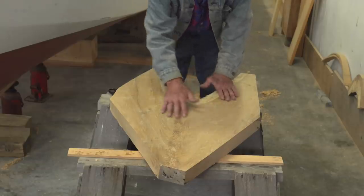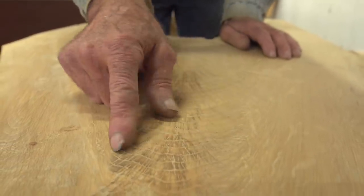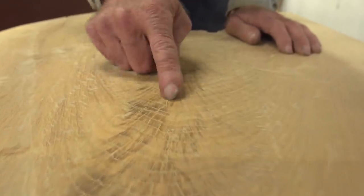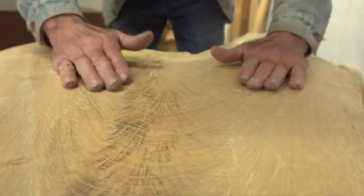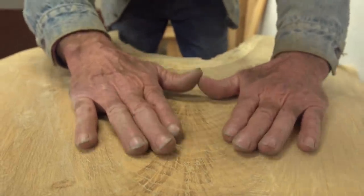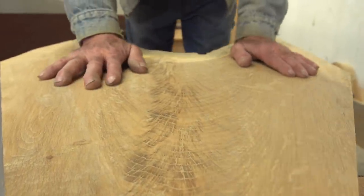Look at the figuring in this thing — it really looks nice. You can see the annual rings in here. They're kind of round up here, but then look in here — they're nice and pointed. All of them are pointed and they line right up with each other. So we're going to try to keep that right down the middle of the breast hook so it looks even on both sides, with the approach angle exactly the same coming in to the center. It's a pretty, pretty piece.